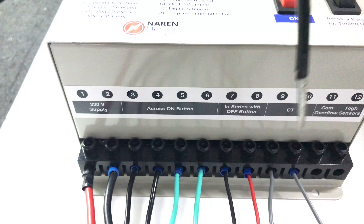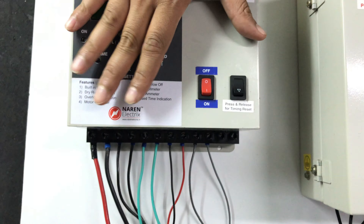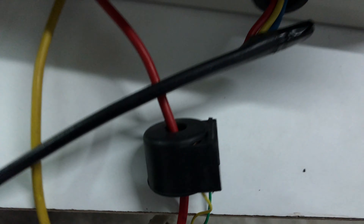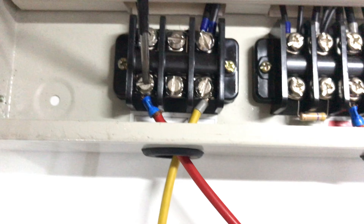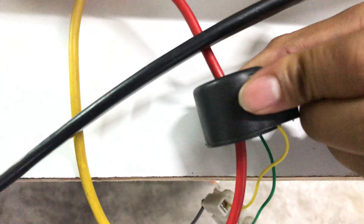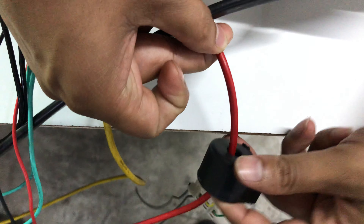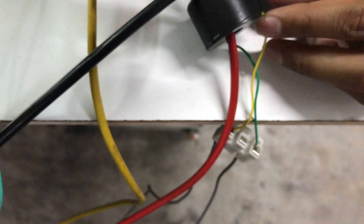What is the CT? If you get the DMC-SP, you get the CT — the current transformer. You get the phase wire for incoming phase neutral. You get the power-carrying wires — the red color wire is the phase wire. The CT has a hole. You pass the phase wire through the transparent hole in the CT. Turn the pin — there are 2 wires in the CT.